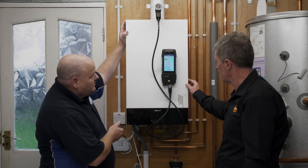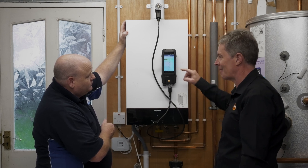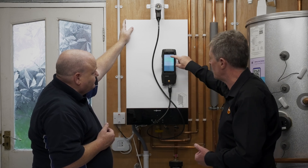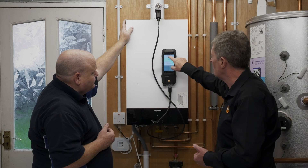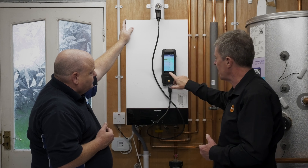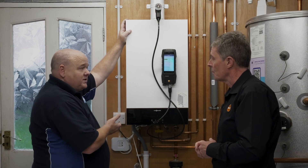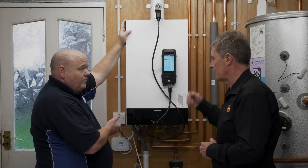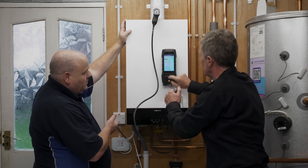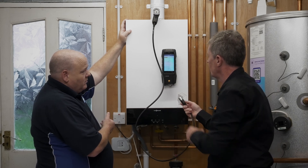So what do we do to start with? When you power the instrument up it automatically boots up into flue gas test as the first test. If you wanted other test functions you'd just go into the drop-down menu and select the test you want, but it will always initially start up in flue gas. You want to make sure it's zeroed — the quickest way is to remove the probe from the flue or disconnect the instrument, start it up, and zero it. Then you're good to go.